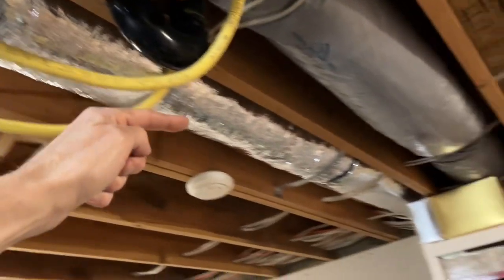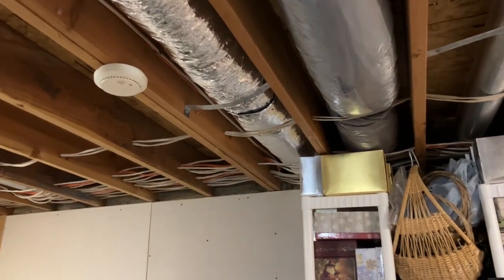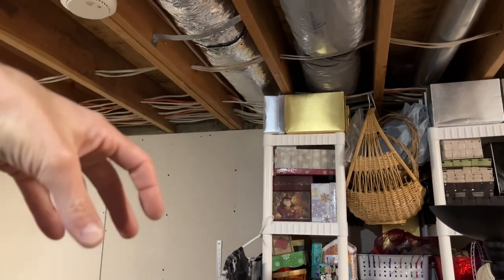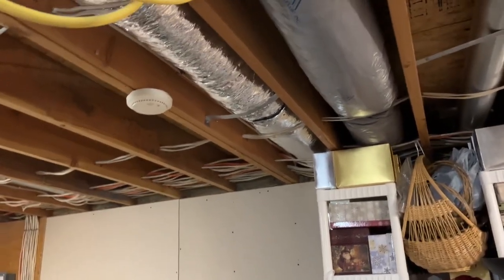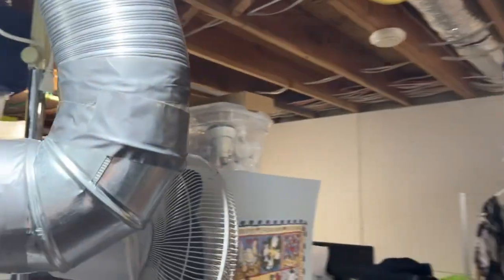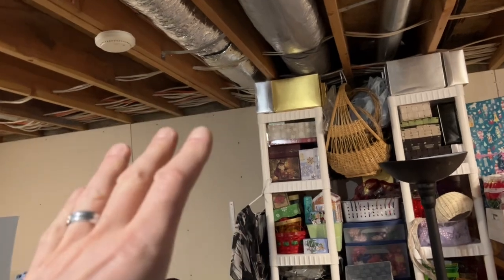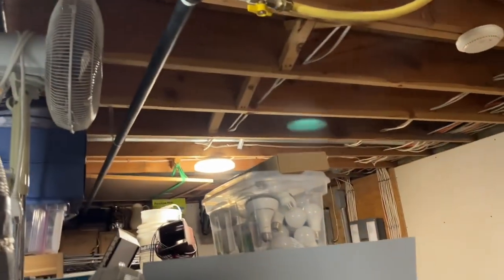The rigid 6-inch section is about 12 feet exact, and then I have my output port outside with a terminator that has a little bend down to it — that's worth another 10 linear feet. So my total is 63 linear feet, even though I only have really 15 feet of physical run from here to there — 63 feet equivalent because of all the turns, bends, and elbows.